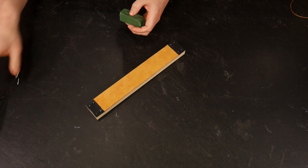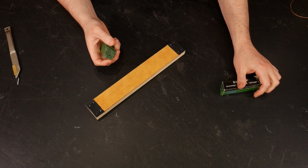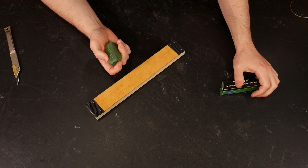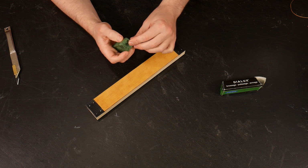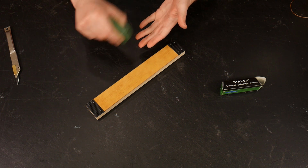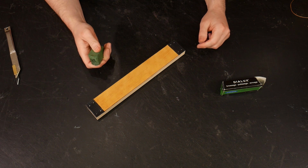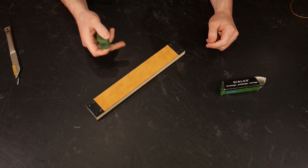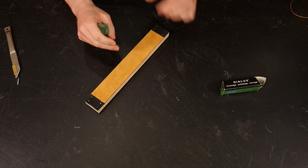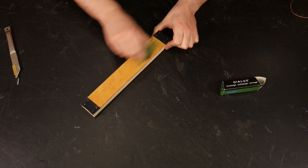You can, and I've got some in a jar actually, dissolve this down in mineral spirits, or white spirits it's called in the UK. You warm it up very slightly if it doesn't get going, but you can use a dollar store cheese grater, just to get some flakes into it, put it in a jar, shake it up overnight, and it dissolves into it. I usually put enough mineral spirits in there so it becomes more of a paste, so you can move it around if necessary. That's probably one of the best ways of doing it.